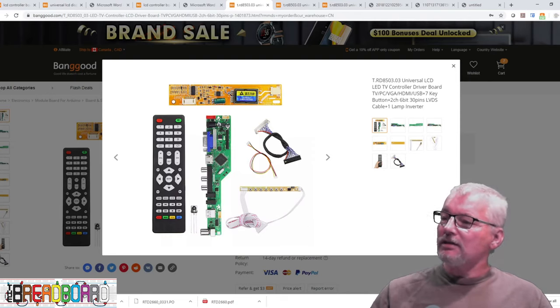Using HDMI out into one of these boards and then up to reused laptop panels, or once I get the right cable, one of those big panels from a full computer display including case — you can get a lot more use out of old monitors. You can pick them up dirt cheap at thrift stores with just VGA inputs, put one of these boards in, and even the first simple board would work fine. Just make sure you get it for the right resolution and bit depth. The more flexible board requires more work but offers more flexibility.